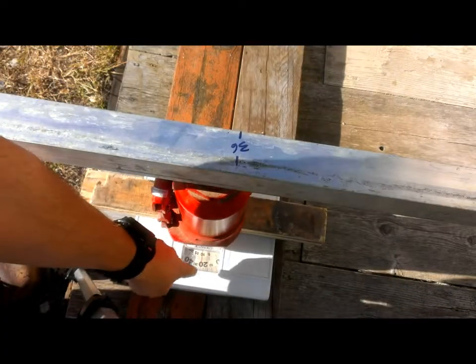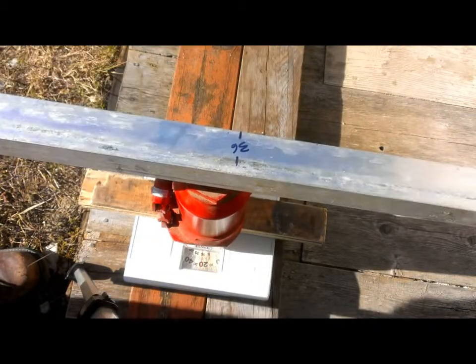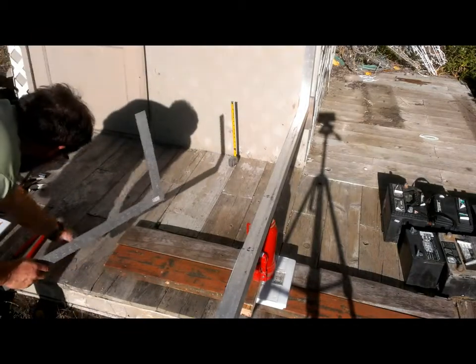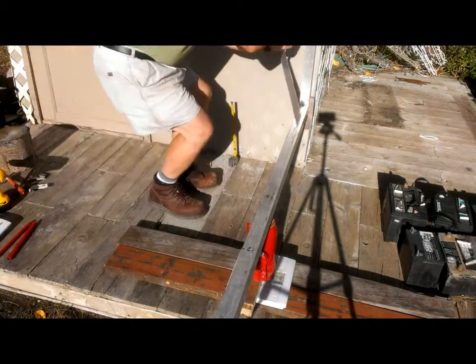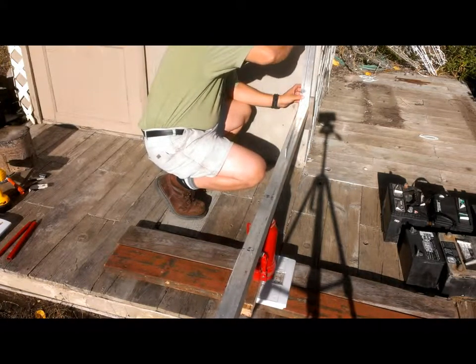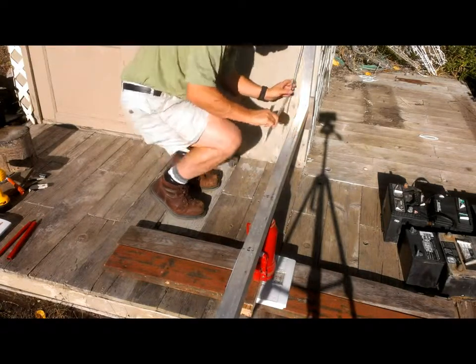Okay, you'll notice that we're showing just under 25 pounds, maybe 24. 36 inches lined up with the inner edge here of the hydraulic jack, so that's the closest that it's doing pressure, so we'll count that as the contact point. And I've got to check for square. Okay, so we're going to check for initial square here with the hydraulic jack not touching at all. So what I've got is my caliper, sitting on the side, sitting on the bottom, I guess. I'm looking at about a millimeter off square at the end of a 16-inch square. So that's decent.